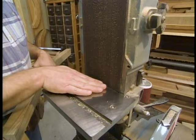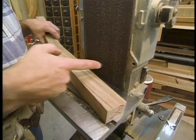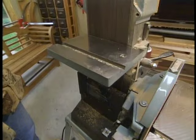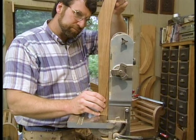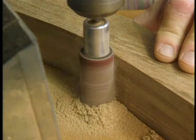Now I'm going to turn to the belt sanding section of my sanding center, which also has a table that's 90 degrees to the belt — I'll use that to clean up the edges of the leg. Now I know what you're thinking: he's going to be sanding against the grain, which is going to leave marks across it. Once I get it where I want it I'll make one light pass in the vertical position to get rid of those marks. The drum sander takes care of any areas that I couldn't get at the sanding center.